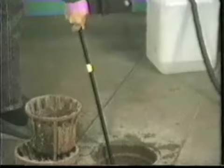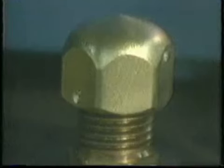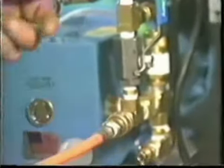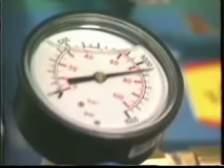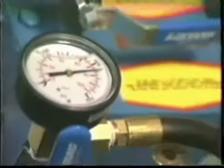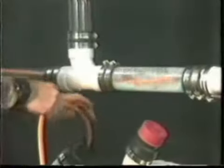The jetter is able to proceed into a T and make dead 90-degree turns with the use of the cornering jetter heads on the 10 and 12E or the 2200 series. If jetting through traps less than two inches in diameter, use the trap jet assembly hose — connect this hose directly to the outlet high-pressure snap coupling. If you connect this hose to a 2200 series jetter, make sure the pressure relief valve is adjusted to give an outlet pressure reading of 1500 PSI maximum before you connect the hose. Not doing so may rupture the trap jet and cause severe injury. With pulse control vertical and pulse eliminator horizontal, or the pulse generator all the way in, the hose should make its way around the bend. Use of the trigger gun is another aid in cornering. Once around the corner, the jetter will quickly surge ahead — resume normal high-pressure pulse settings and continue to jet.